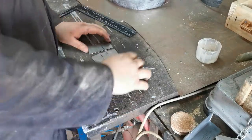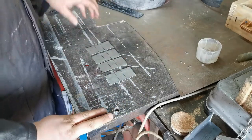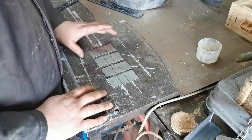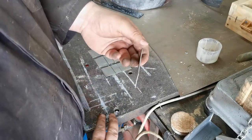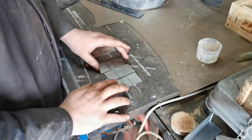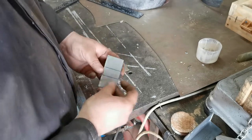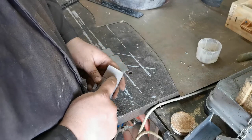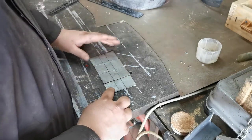We're going to be making hinges — it's probably going to be a short video on how I make hinges. I've cut out rectangles out of 1.2mm mild steel. I've got four of them because you'll need two per hinge. I've marked three centimeters on one side, a two centimeter gap, and another three centimeters on the other side.